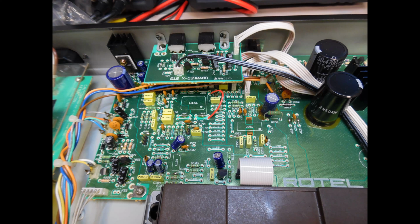Thankfully in this case this brown glue hadn't already dried out, so this corrosive and conductive effect really hadn't come in. But we know historically if that glue does dry out, it will cause damage to the circuit board, and also it will cause premature failure of the components. And then if the brown glue is connecting to maybe links or other component leads, then that means that current will pass into areas of the circuit that it should not, and again can lead to failures, or in some cases unusual operation.